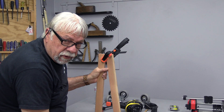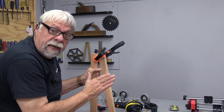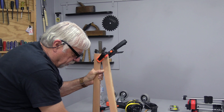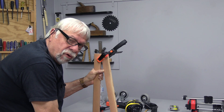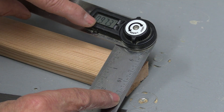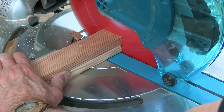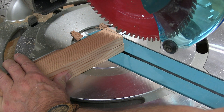On the floor I have what's going to be the stand or base of this. This back part is going to be vertical — straight up and down — because I want to be able to push it right up against the wall. The only part that's going to be angled is the front side, and that way I'll still be able to put some clamps in the middle. I worked out the angle of the base and I'll cut both pieces at the same angle — turns out it's 97.3 degrees — and I'll just set that up on the miter saw. Then I need to cut the tops off the two angle pieces at the same angle so I don't even have to adjust anything.